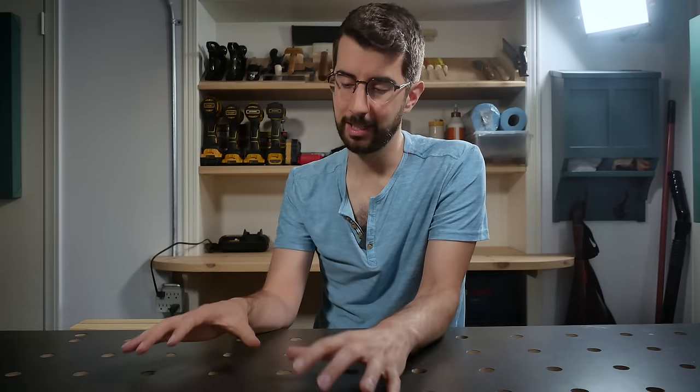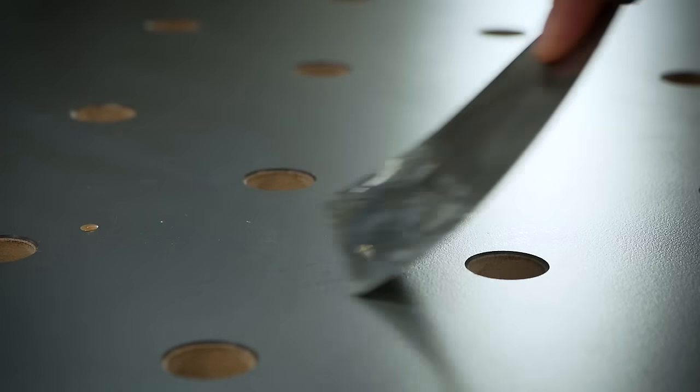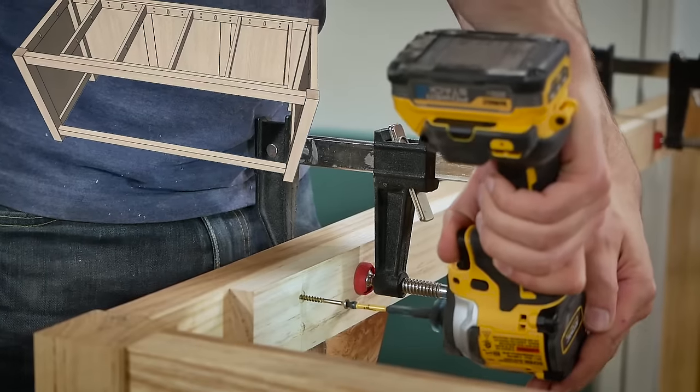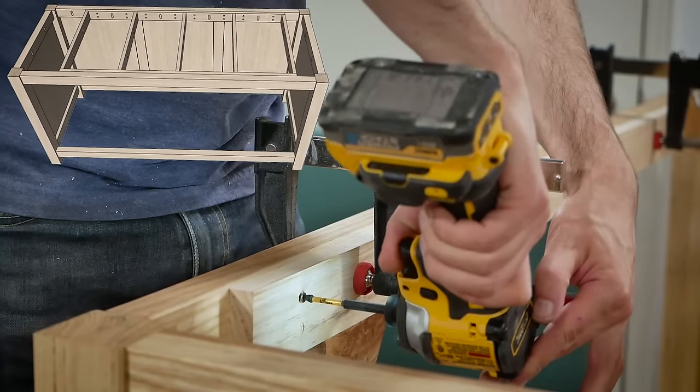The surface of your assembly table might be prone to collecting little bits of dry glue, and that might cause dents in your workpieces if you're not careful. Laminating a product like Formica on your top is a great way to be able to easily pop off bits of dry glue. I wanted my bench top to be super strong, so some sort of support structure would definitely help.